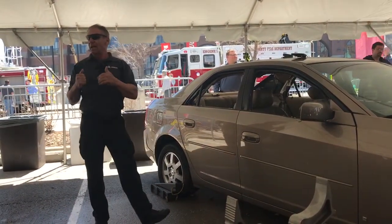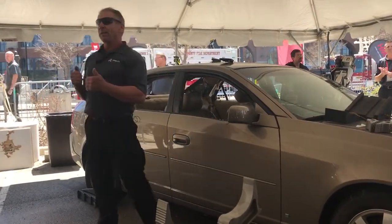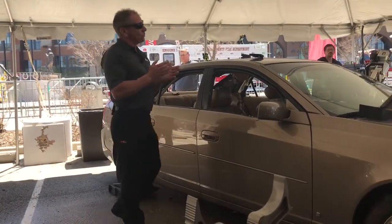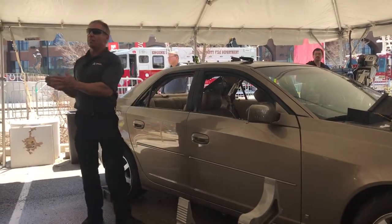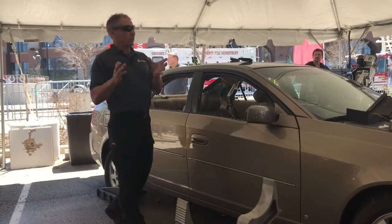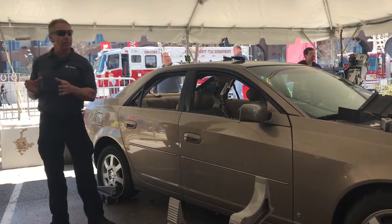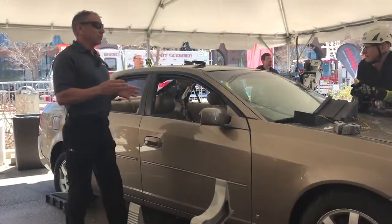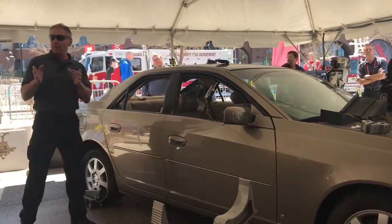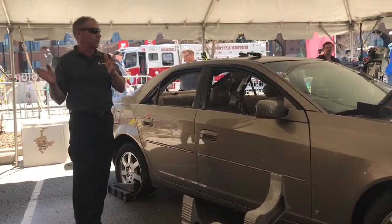That's fine, but what happens when you start dealing with patients in the real world, such as in a extrication? One of the things you don't want to do is wait 20 to 30 seconds to make a cut. If you've been acclimated and used to a certain amount of performance, you don't want to compromise the performance by going to battery. That was one of the things that was hard for us. For those of you that have been using AMKUS or are familiar with AMKUS, we've always been a performance-driven company. We've maintained that. So with the single stage pump, we may get from A to B a little bit slower than some of our peers, but we're getting from A to C significantly faster, in some cases 20 to 30 seconds faster.